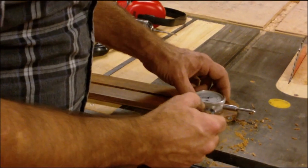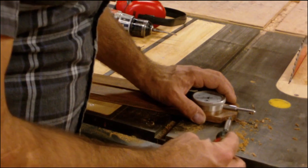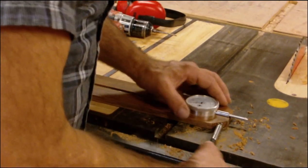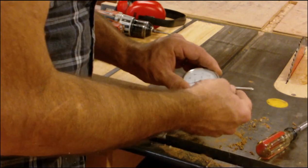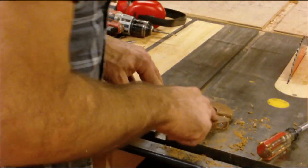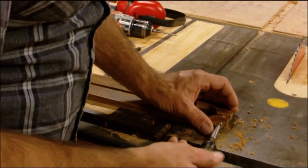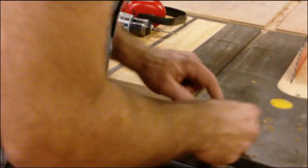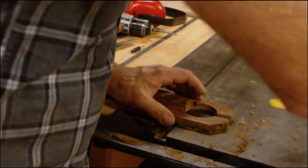What we've got here is that because this hole was sloppy, when I go to tighten it down, it squeezes this up out of here — even though it's not the wrong size. I tried to clean it up with a chisel but I'm still not satisfied, so I'll run this through the saw and make this slot wider, just right here. And that should do well.